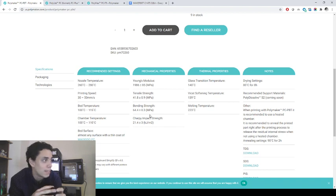It's specifically great to have, with such a technical material, that you are still able to use soluble supports. That's also one of the things that other desktop systems might not offer, right? If you think about more entry-level printers, let's say printers that only have a heated build plate and do not have soluble supports for higher temperature thermoplastics, you're going to struggle a lot, especially when printing more complex parts, right?